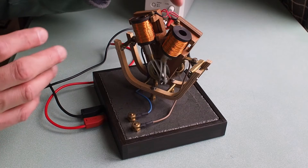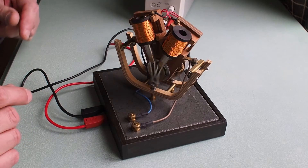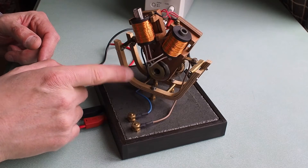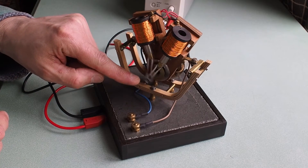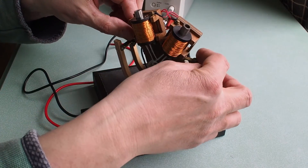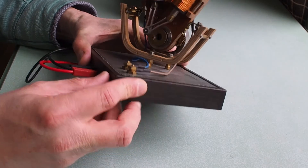Interestingly, the whole engine is built with metal and wood. There are bearings in the main crank. The crankshaft itself is made from steel with a brass web on the back and a steel pin. There are tiny little bearings in the con rods. The motor with the V section is mounted in a cradle, as you can see here.